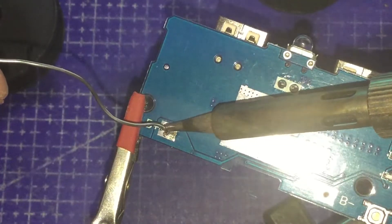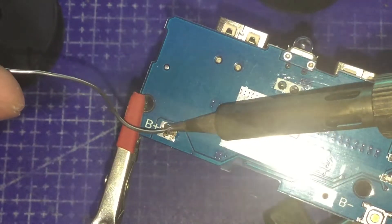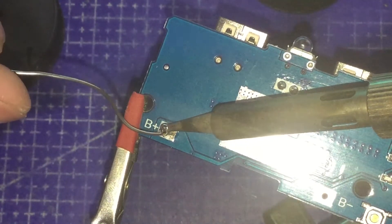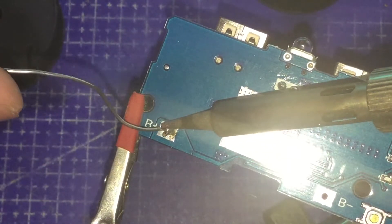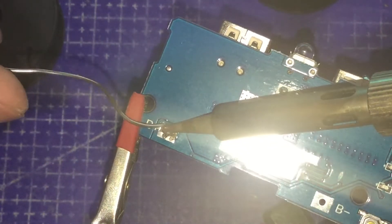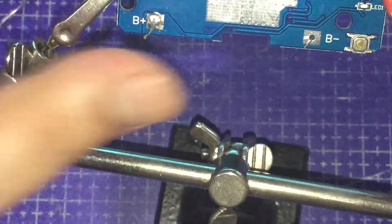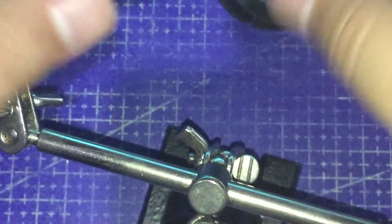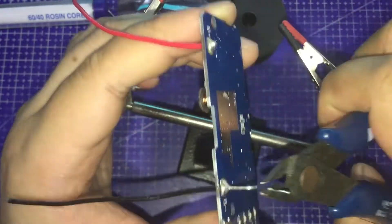As mentioned, we're going to solder some hookup wires onto the positive and negative terminals of the charging module. Also, if you're going to be soldering onto a large-ish pad, use a bigger soldering tip for faster heat transfer. As you can see here, I did not do that because I forgot. Next is the negative or ground terminal — apologies if you can't see it clearly, I did not notice it was out of frame.